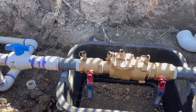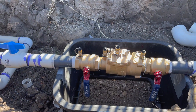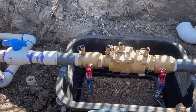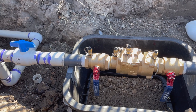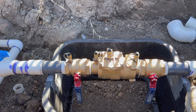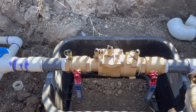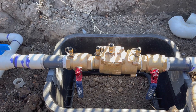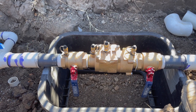Now one of the main differences is a few years ago they changed the rules to where you don't need a Y strainer before the double check. That's one of the things you see that's different here from some of my other videos done several years ago. You don't have to have a Y strainer before a double check backflow in the state of Texas, so it makes the installation a little bit easier — just one less component you have to worry about.